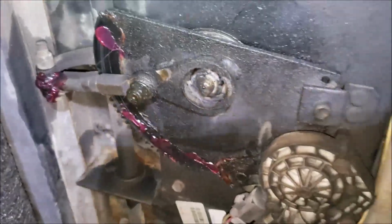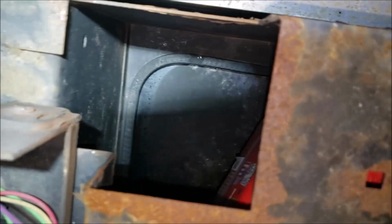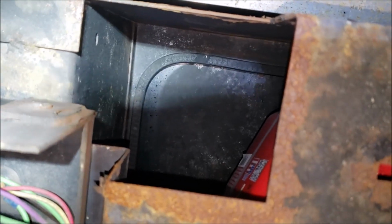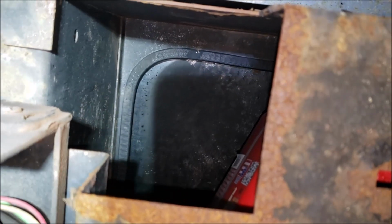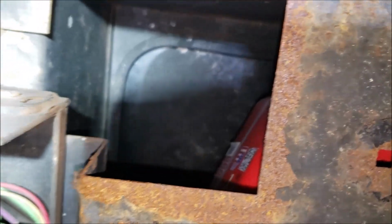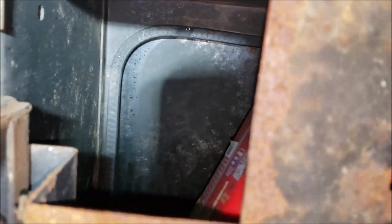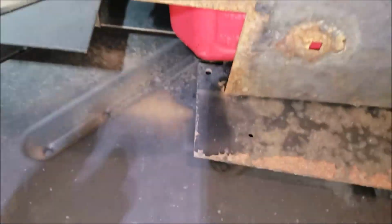All right, I got my step all greased up. Something else I thought of while I was under here, if you got these squeaky steps and you got a Winnebago like this, and you got the battery compartment under your steps, pretty common layout, and if you're thinking I'm going to do an upgrade, put in bigger batteries and stuff, be cautious and be careful. Take the top off the step, and then let the steps come in all the way, and watch where these arms go, because these arms protrude into the battery box. So you may be thinking, I'll just stick me in some bigger batteries, but you may do that, close the steps, and have this metal bar pierce a hole in your new battery. So be mindful of that if you ever go to do a battery upgrade.